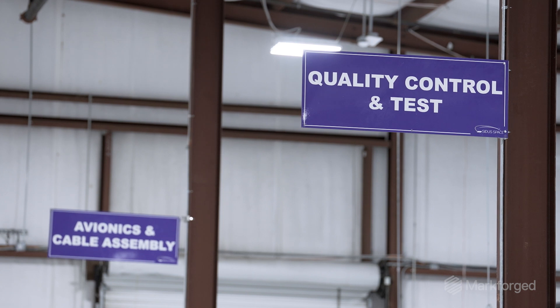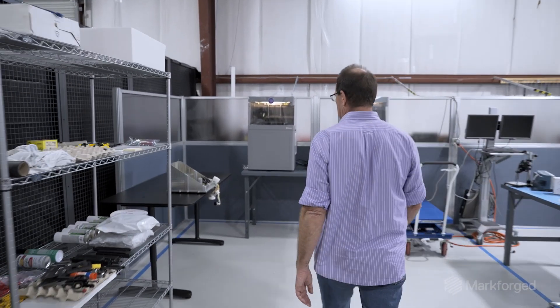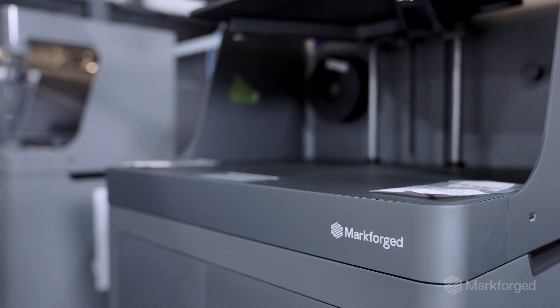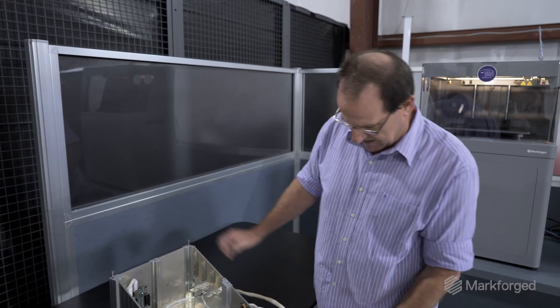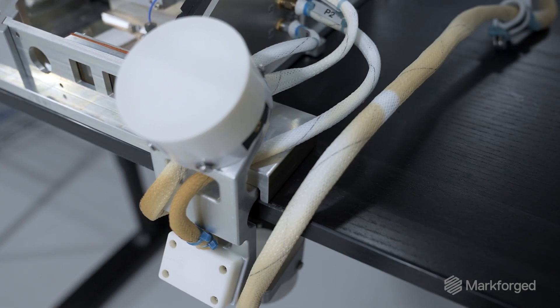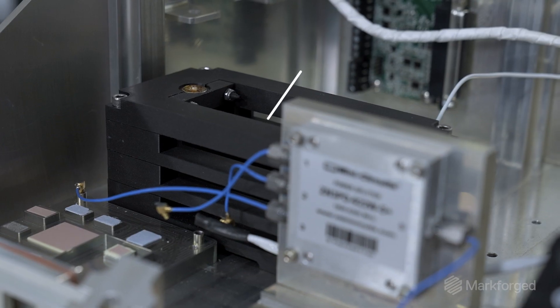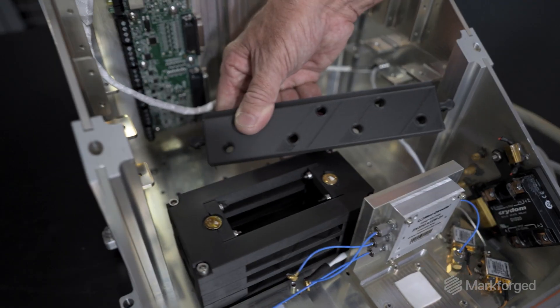We actually received a grant to build a flight test platform — it's the beginning stages of a satellite. We were able to send that up to the International Space Station for a while and then bring it back down and test those materials. We rapid prototyped the sample holders out of Onyx, put them in this experiment, and they went up into space. This went up, and as you can notice there was degradation on the white parts because the sun degraded them so much being out in a space environment. But all of the Onyx parts — no degradation whatsoever. There's no difference between a part that's just come off the machine and what's been out in space for a year.